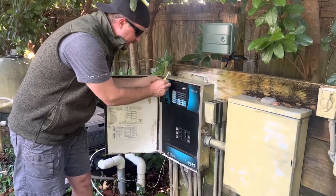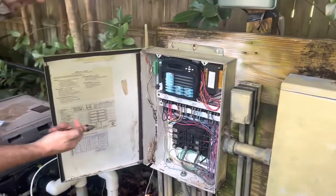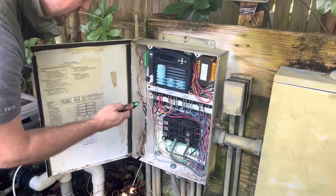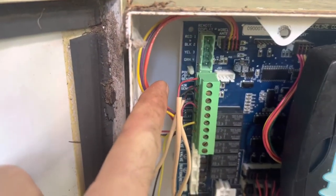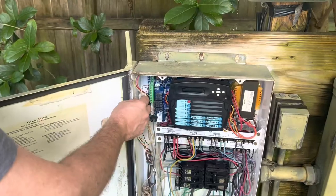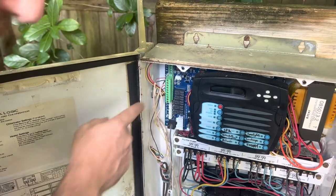Control panels will be a little different — this one's got two screws on the top. This will tilt out and you'll see a whole lot of wires in here. If you have a non-contact voltmeter or any type of voltmeter, you can check to make sure you don't have any more power anywhere. We're going to take the wire we traced from that temperature sensor and zoom in — you'll see it says pool/spa sensor and below that, air sensor. The two top wires are what goes to that. You want to take a really tiny screwdriver and unscrew the two screws to loosen up the red and the black wire.